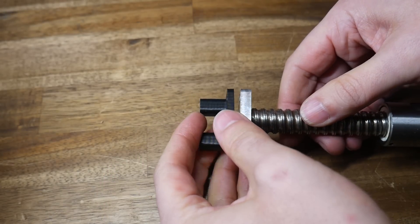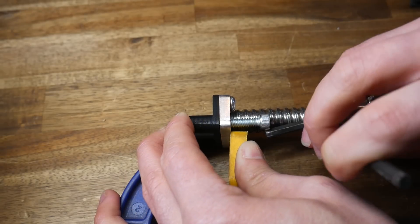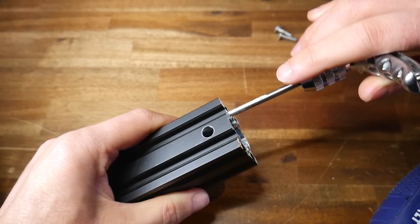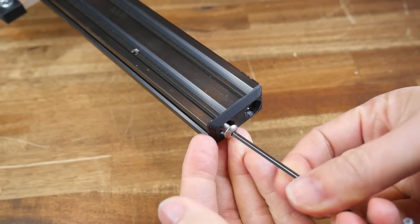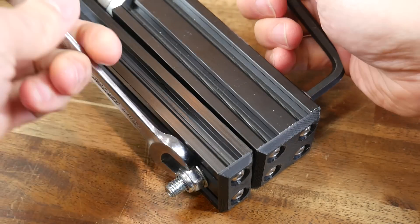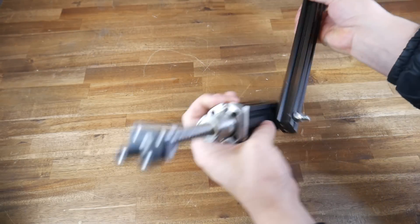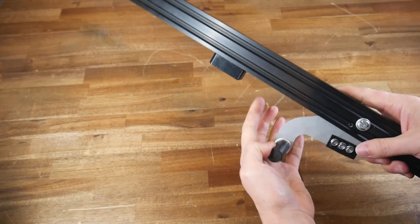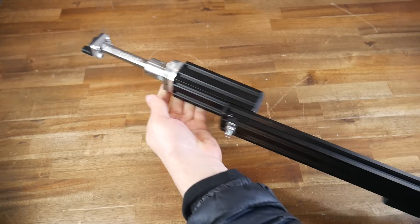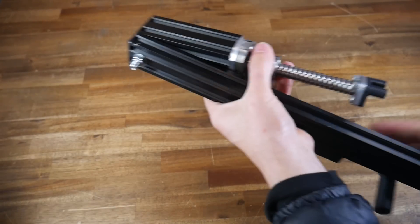I then have a final 3D printed component that interfaces with the pedal while protecting the surface. It slots over the top and a series of bolts join the two together, with the larger bolts being structural because they go the whole way through the plastic and prevent it from breaking under load. To finish off, I tapped threads in the ends of any extrusion that didn't already have it and screwed on some 3D printed caps to take away the sharp edges. Everything was then bolted together, hopefully for the final time, and done up pretty tight — the idea being that these joints can pivot under load but don't flail about when I'm trying to feed the whole thing down through the footwell. Here is the finished product. It took a lot of development, but I've arrived on a design I'm quite happy with. The rubbery pieces will prevent scratching and corrosion, and the length of the whole mechanism can be fine-tuned by winding the ball screw back and forth to perfection. When done, it folds back on itself for more compact storage.